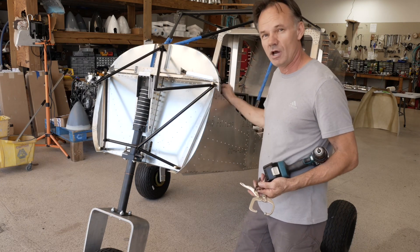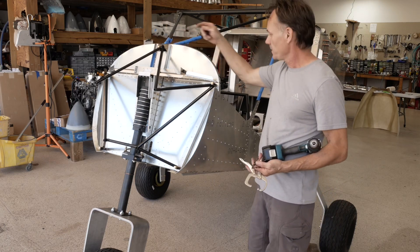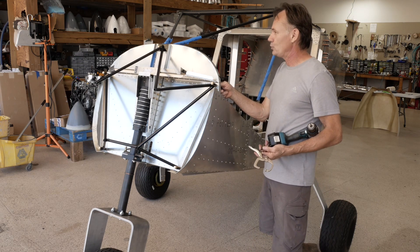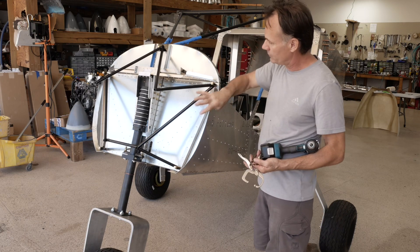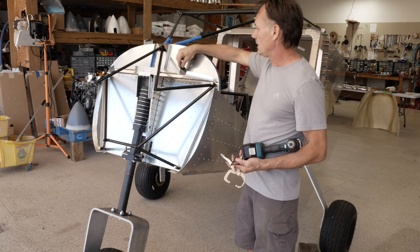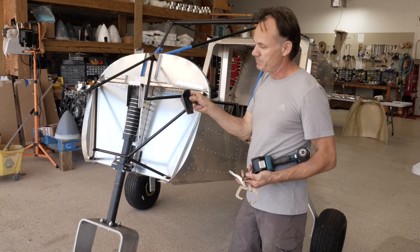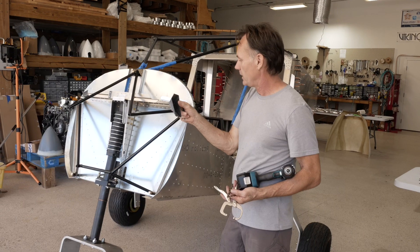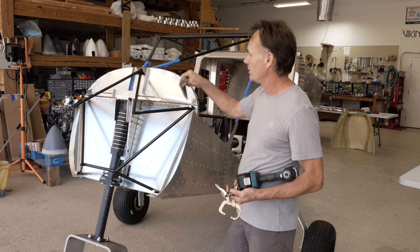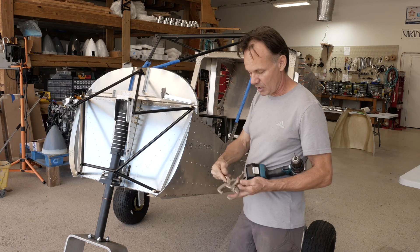We had to pull each hole just a tiny bit while drilling, but without forcing anything. We then put the two top bolts in that came in the kit from Viking, put some temporary spacers and temporary non-locking nuts on the back. We're doing that because we want to hold the mount firmly on the airplane prior to working on the top part. Also, the steel weldments are not installed in this airplane, so we're going to fit the mount and then fit the steel element in one corner as we move along.